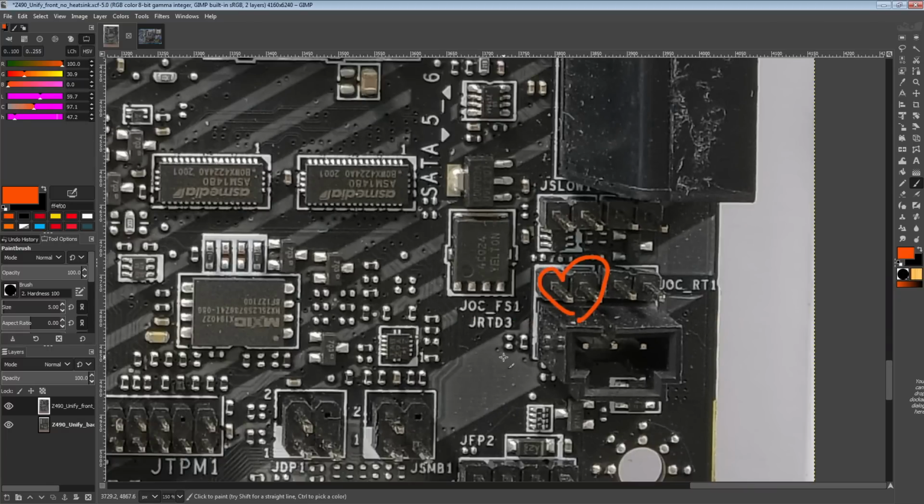This is MSI's clunkier version of safe boot. Basically, as the motherboard is powering on, you hold this down, and it has to be right as it turns on, at the very beginning of the post process. You have to short that jumper, so get your own button for it.